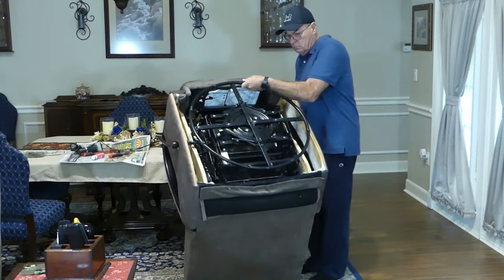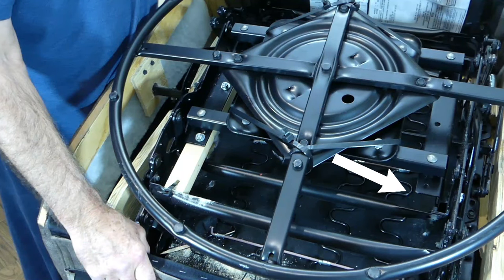So now let's put it on the floor and try it out. We have no rock, and the chair reclines normally just like it should. It's a little bit jiggly, and that's because we just put on one piece of 1x2. If you'll add the other piece to the other side of the chair, you'll stop a lot of that jiggle and make your repair twice as strong. Folks, be sure to send me your comments and your questions — it may take a day or two but I will get back with you. Don't forget to watch for that upcoming video on how to stop the recline. And folks, that's going to do it for today — so until next time, thanks for watching.